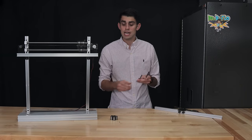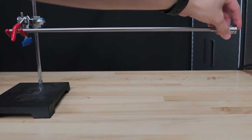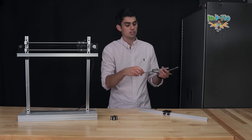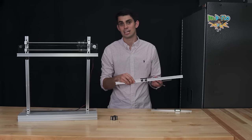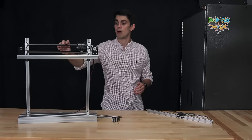But most importantly, the linear motion bearing that rides on the rod is significantly cheaper than the wheels that ride on the V-rail or the ball bearing carriages that ride on a normal rail. I'm talking pennies on the dollar. We will cover V-rail carriages in the next section. With the cost being more, is there a reason to choose rails over rods?